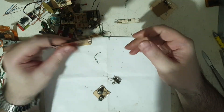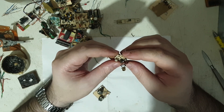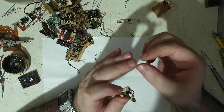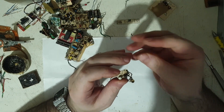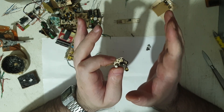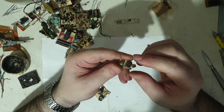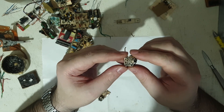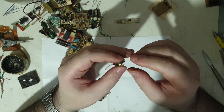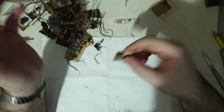One circuit is not on cardboard but on plastic — and I quickly learned that when you push a hot wire into plastic, the heat expands the hole rather than gripping the wire, so it just falls through. That was a lesson. This circuit has two transistors, and one transistor whose top I cut off to convert it into a photodiode — when pointed at light it catches it, and the two transistors amplify the signal to drive the LED.